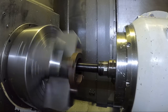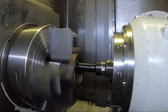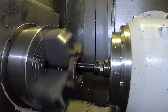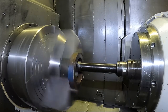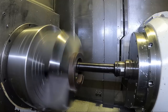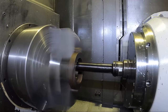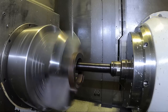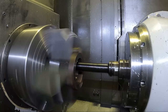People have asked why I run a manual four-jaw chuck on the CNC machine. This is actually a small chuck for this machine. The original chuck is a 21-inch Kitagawa hydraulic three-jaw chuck. The problem with these multi-task machines is if you put too big a diameter chuck, you have interferences. When the B-axis is at 90 degrees - facing straight down with the milling spindle - and you're close up to the chuck jaws, you run into the chuck, particularly with a large chuck like the 21-inch. This is a 16-and-a-half-inch chuck OD on this four-jaw chuck, and it causes interference problems - that's one reason.